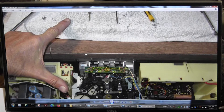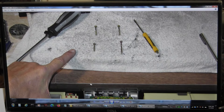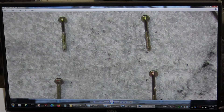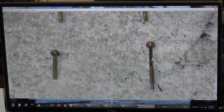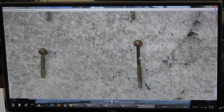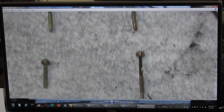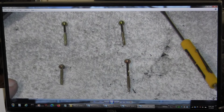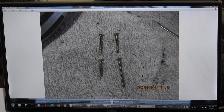When I took the tape deck screws out, the two upper screws are the same length. This one is shorter than those, and this one is longer in that orientation. So: two medium-sized screws at the top, the one short screw to the side where the motor is, and the one extra-long screw to the other side. That's what it should be.